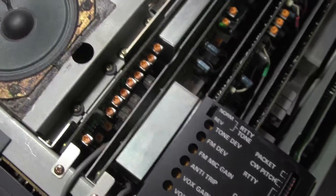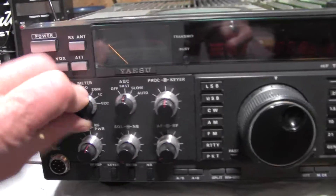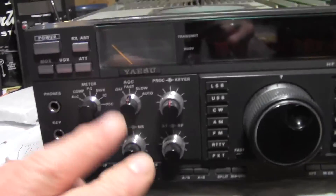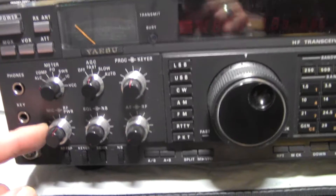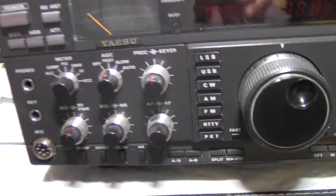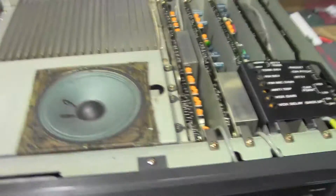The next procedure is that you put the radio into CW mode, and then you put it on ALC, boot it up, go to 5.5 MHz, and probably keep your power down halfway — it might be a good idea. Go into a dummy load, push your MOX button in — so that means no microphone in line — push the MOX button in, and adjust.